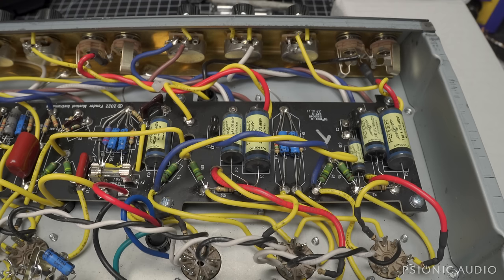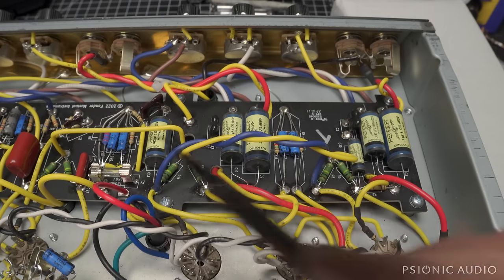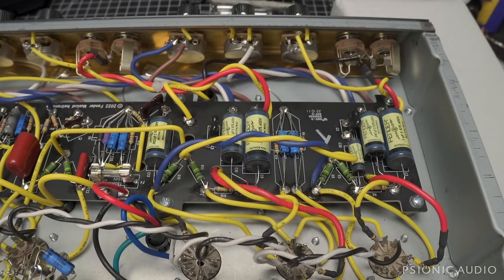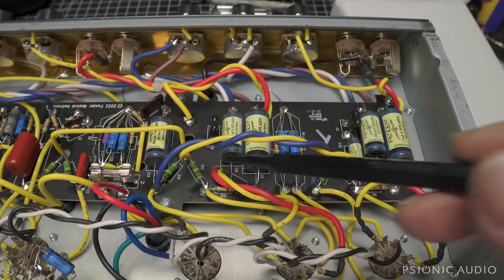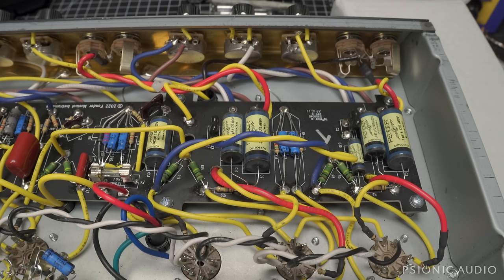I have a problem with Fender selling this to people who don't know any better, and all the channels out there telling you how great it sounds. And maybe if the amp you used before sounds even worse, you do think it's great. But compared to an actual 1964, 1965, 1966 Deluxe Reverb in good shape, this is a noisy beast. You heard the self-noise of this amp at the beginning with the volumes and reverb off. This amp should be silent at that point, and it is not.